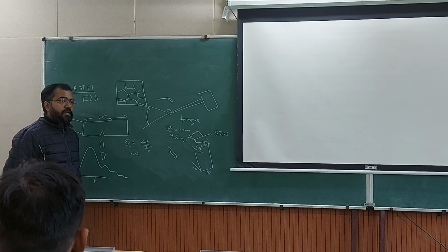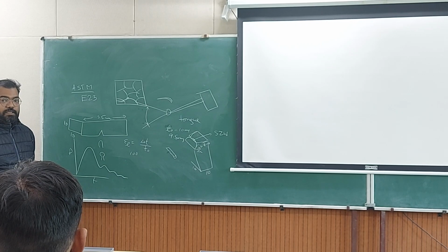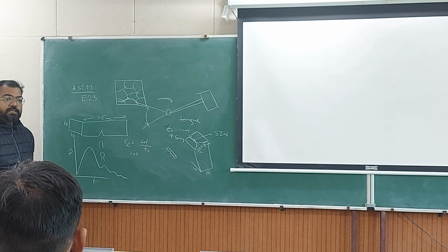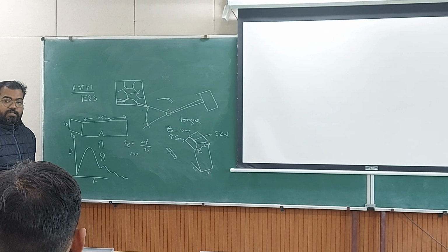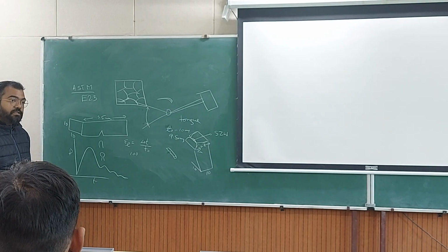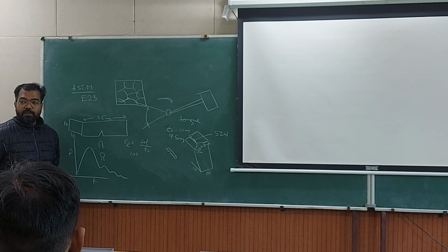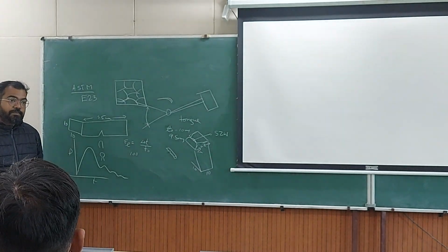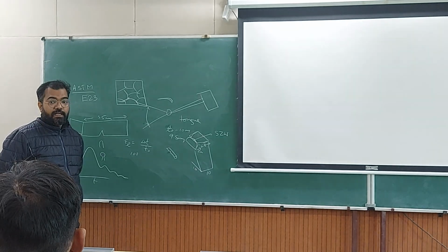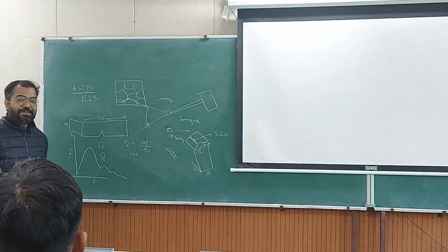Okay, so you can calculate another parameter, which we will discuss, using the Charpy impact test equipment, but you have to make it instrumented. So you have to do some instrumentation for putting the strain gauge and other things. You don't put the strain gauge on the sample because at lower temperature you are putting it at liquid nitrogen, so the strain gauge will not work. And when the sample breaks, the hammer will hit, so the strain gauge will obviously not work. So you don't put it there.